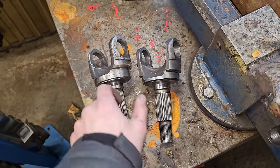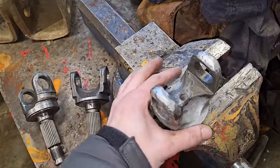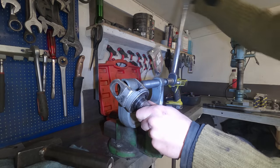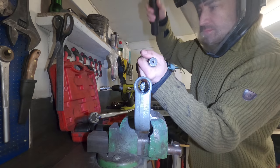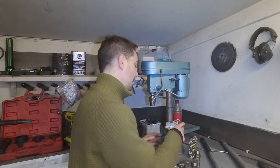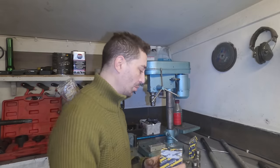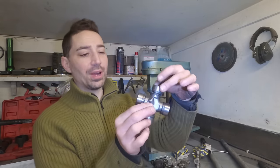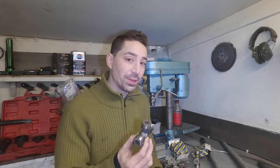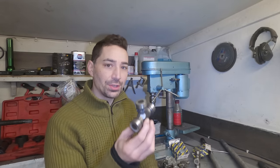With the heater reading zero on the carbon monoxide detector, I'm moving on to the broken U-joint on the chromoly shaft. The eyes of the stub shaft got badly damaged, so I've straightened them as best I can using two standard stub shafts as templates. We get some top quality parts here in Europe — checking out Japan parts. Broke one already, just arrived: tried to fit it and press it in and the bottom of the U-joint cap cracked off. These are always supposed to be temporary. I wanted to make up two spare shafts using these cheaper U-joint parts, and then put 5-760X U-joints from Spicer into the chromolys — I've actually ordered two of those but they won't be here for another week.